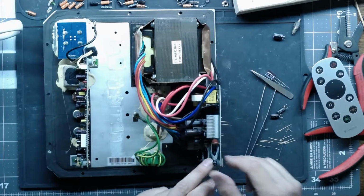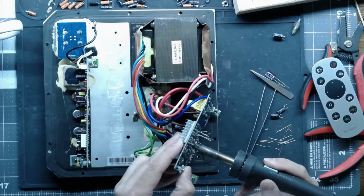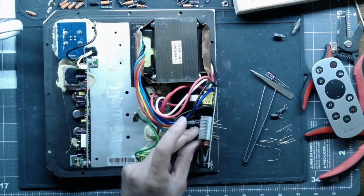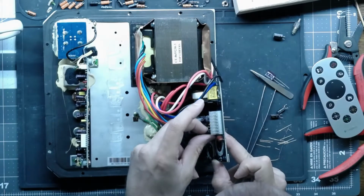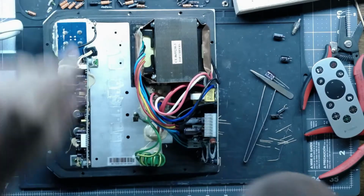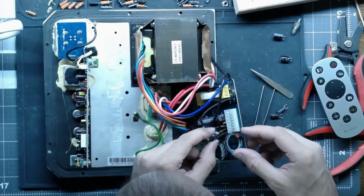Anytime I can, I prefer to use the UPS caps. They're just so much higher rated for life and temperature. Even with the best caps, though, they're going to dry out with age. 20-25 years seems to be pushing the limits for an electrolytic cap. Ceramic caps, film caps, typically those will last forever.